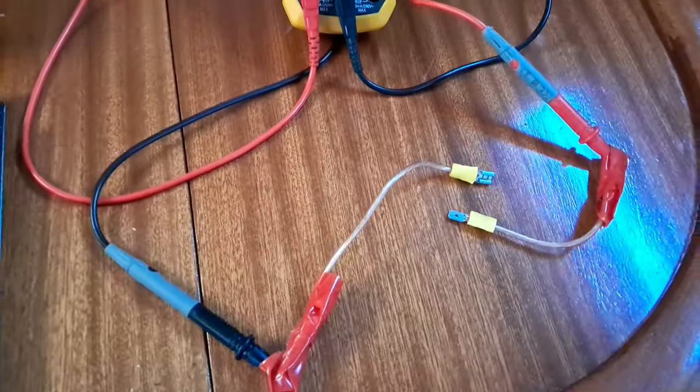We've had all these voltage problems and somebody from the Sail Cruising UK Facebook group suggested we check the current through the compressor. The idea was that if the compressor motor was seizing, as we suspected, it would draw a lot of current. I made up a special adapter to connect the multimeter into the circuit. The fridge is rated at 40 watts at 12 volts, so doing the arithmetic it should be drawing 3.3 amps under normal conditions. I plumbed it all in and turned the fridge on.